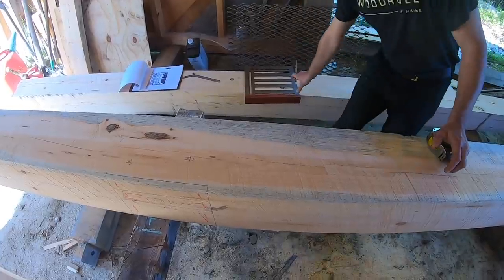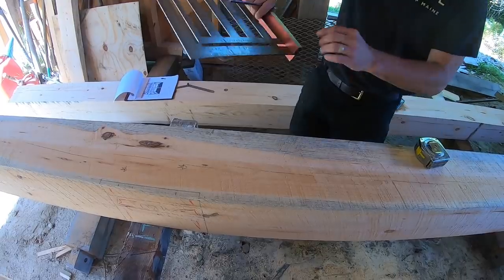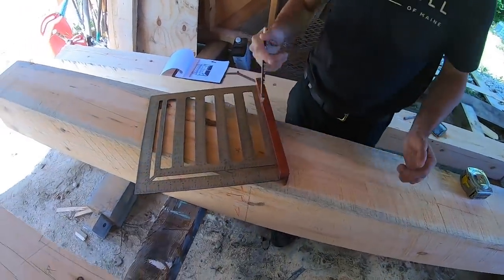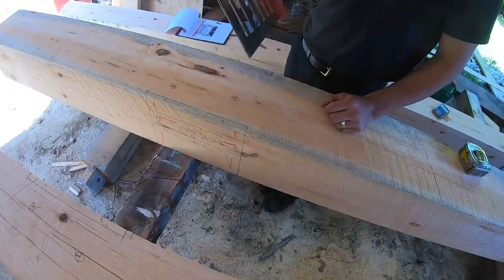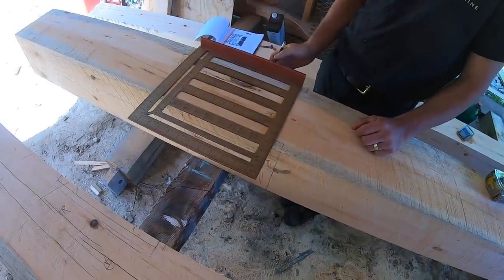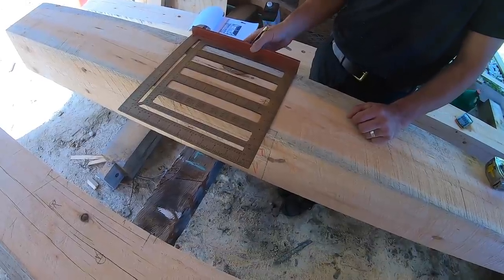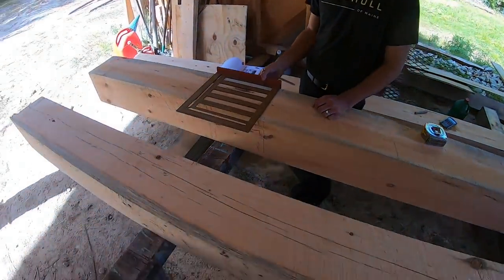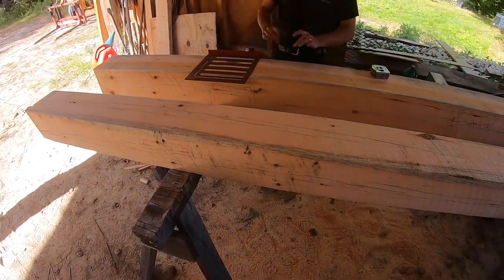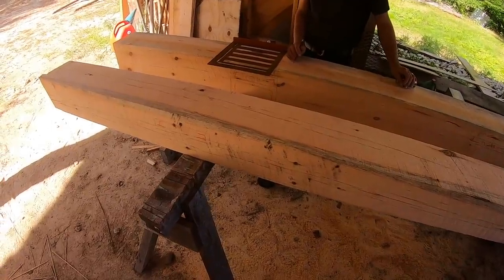I've never seen one. This is the super fancy one. They make one without any measurements on it. But that inch gradient, because everything you're doing is in inches. And if you flip it over to that side, you have half inch gradient. It makes it so fast. It's a layout square. If you're doing this a lot, this speeds up the process. You could do it with a framing square, but it's a little more time consuming.